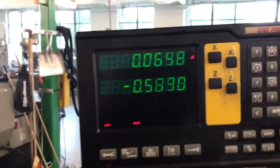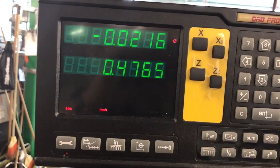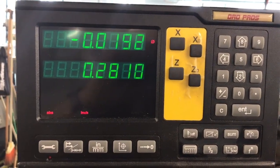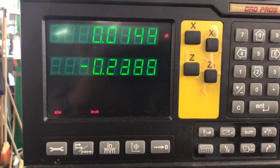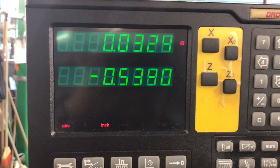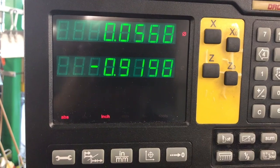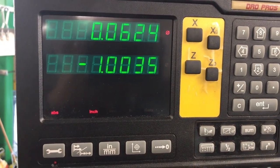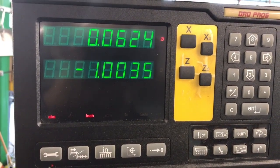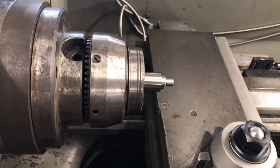Come back up here, move back, start moving back towards the chuck. Zero out both axes. Go about feeding over one inch — and we are right at it: 62.4 thousandths. Honestly, for what we're cutting here with the pipe threads, that is more than sufficient.